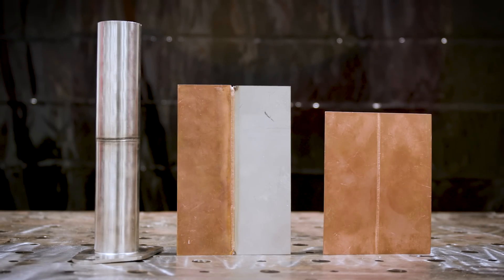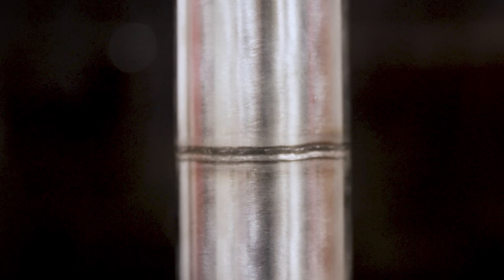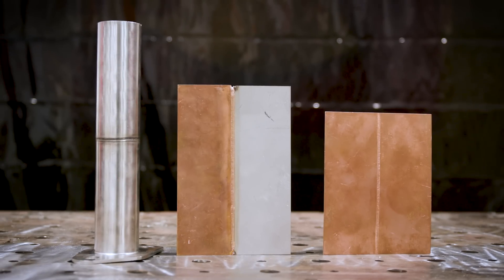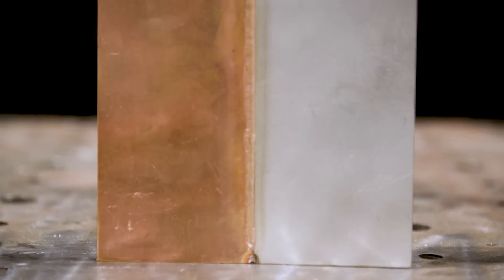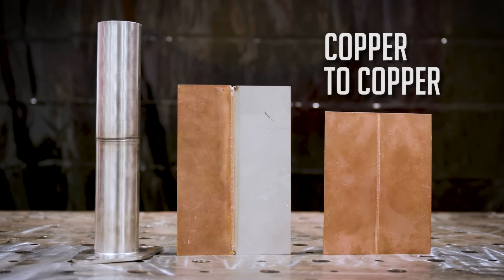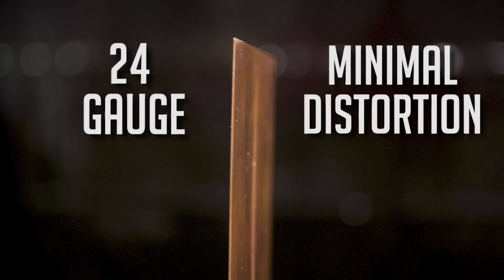So I'll go ahead and clean this up with a wire brush — look how nice and shiny it is, and look at the quality of the weld. These are some samples that were sent to us from IPG that they did in their lab. To the left there is a piece of inch and a half pipe, and you see the butt weld there that came out really nice, and also welded the flange to it. Then to the right, which I've never done before, it's very fascinating how you can take copper and weld it to stainless with that laser — I've never seen anything else do it with a rod, MIG welder, or TIG welder. And all the way to the right, you see how the copper's butt welded together in a nice, thin, sleek little weld. That welder does a really good job.